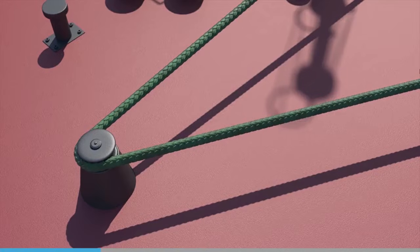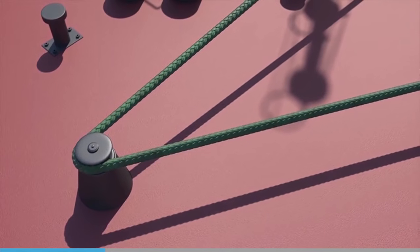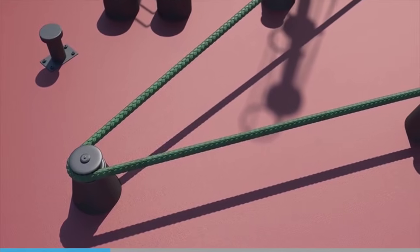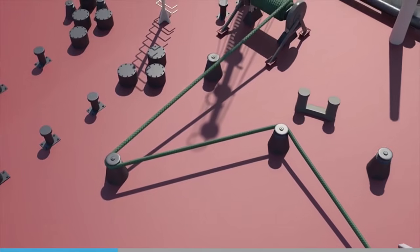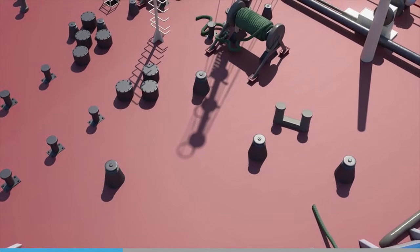When a rope is under tension, it stretches. Depending on the material, this can generate a lot of stored energy. As a general rule, the more stretch there is, the greater the stored energy. If the force is beyond the breaking load, it will fail. The energy suddenly releases when the rope parts, causing the two ends to fly away from the break point.